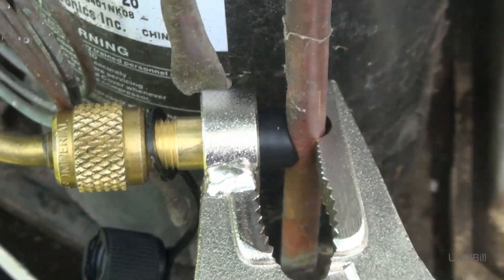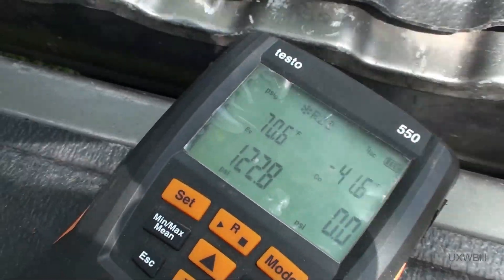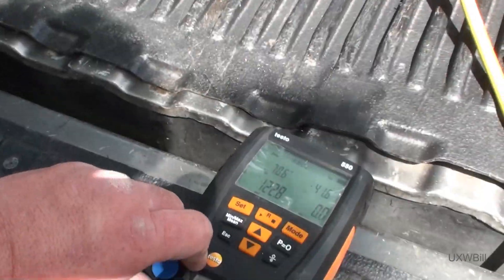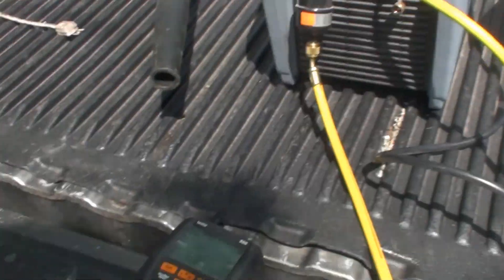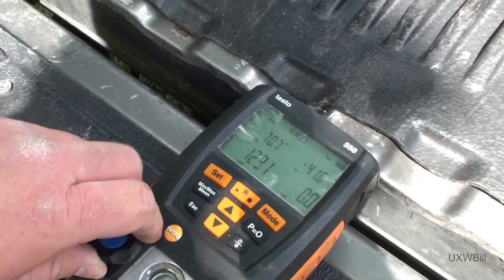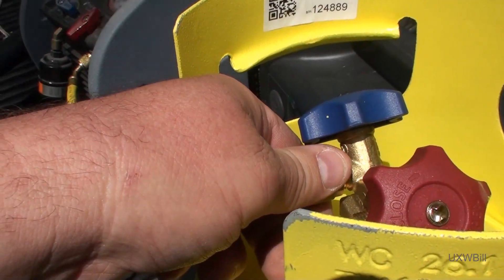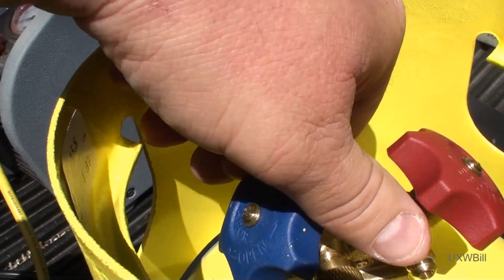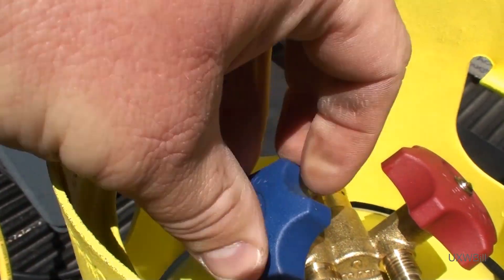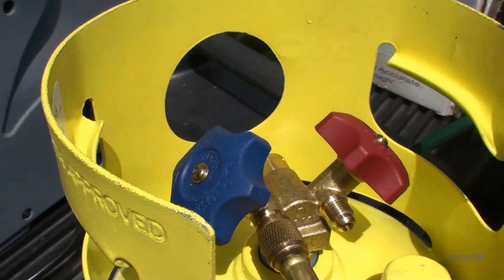Okay — that time I sure got it. I have no idea if it's leaking or not, but we are definitely under pressure here. So we'll go ahead and open this up and make sure these hoses are as tight as I think they are. Got a freshly vacuumed down recovery cylinder. We'll open this up, and open this up, and bleed clear back to here. Again, this cylinder is under vacuum, so we're probably going to end up pulling a fair bit of the charge just by virtue of that fact alone. You can definitely hear it flowing.